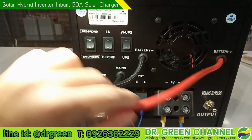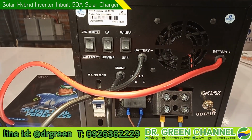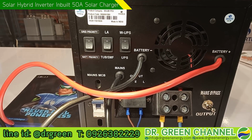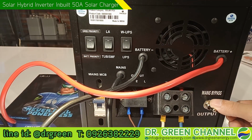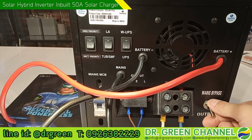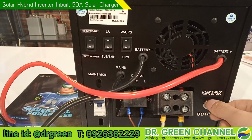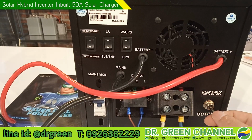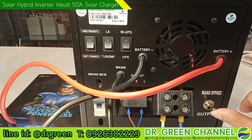And the last but not least, you are now seeing the bypass switch. So every time doing the installation, you have to make the output to this position. In the middle position, everything off, so no output. Okay, and the inverter will be off as well. If you push the position of this switch up, it will do the bypass.